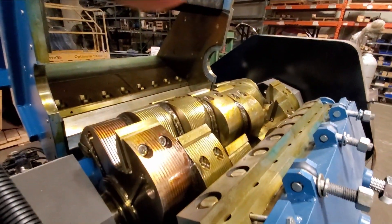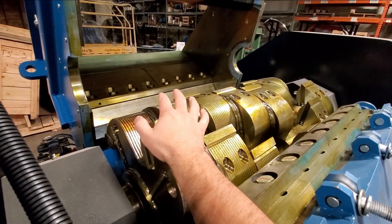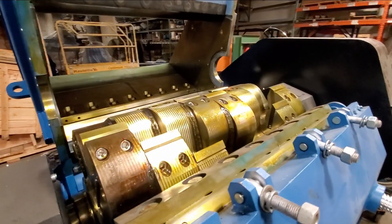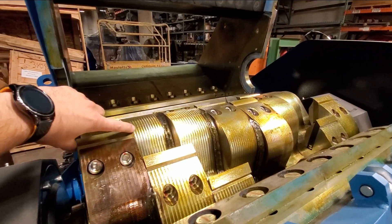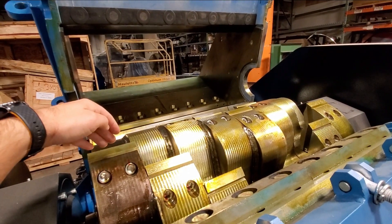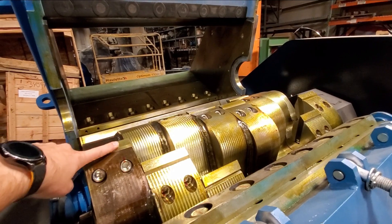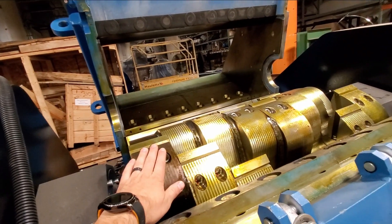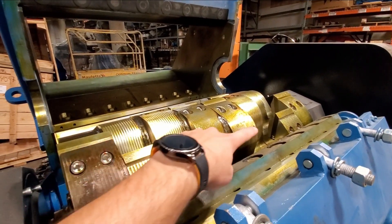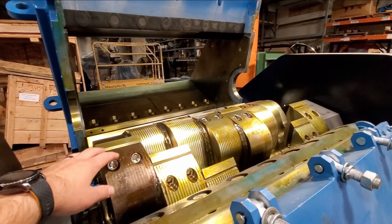There are a few things about this granulator that I really like. One is the rotor — we like using this rotor. We switched a while ago on this style to using a staggered tooth rotor, and I'll give you the downside as well. This machine is 120 horsepower, and as it's cutting, you have all 120 horsepower on just this one blade at a time. Then it goes from that blade to the next, which is set back a little bit more, and so on. There are five rows of staggered teeth like this.